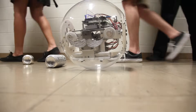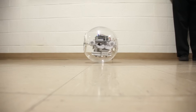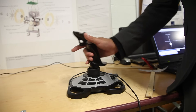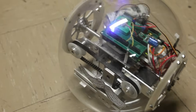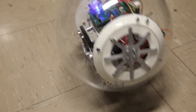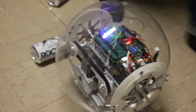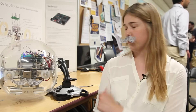This is Fido. Fido is a spherical robot and right now he rolls, controlled based off of this joystick controller — any way that you turn the joystick is where Fido will go. The special thing about Fido is he's self-balancing, so without self-balancing a spherical robot would just always be falling over to one side. We've put in a weight carriage on a closed loop so that it knows how to balance itself, and all you have to worry about is setting the direction you want to go.